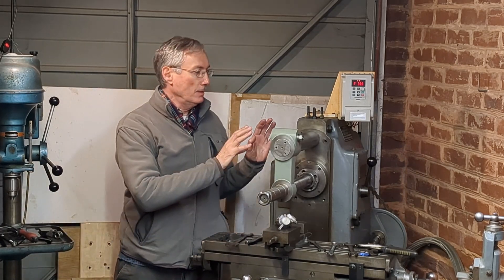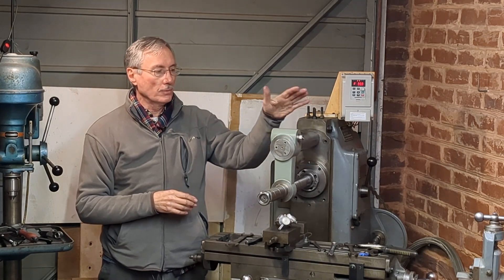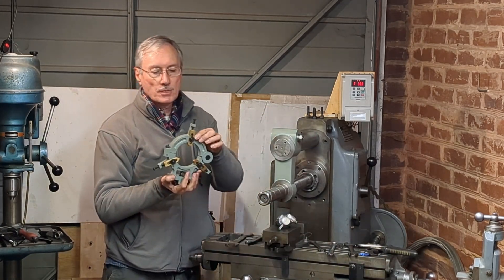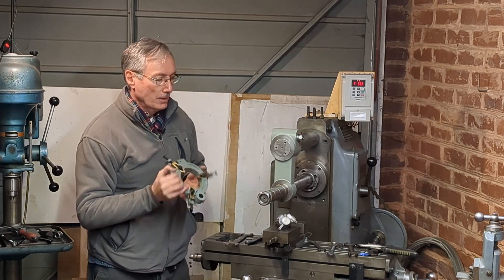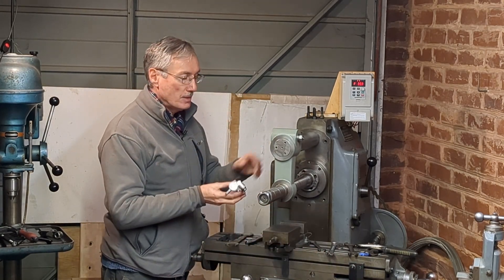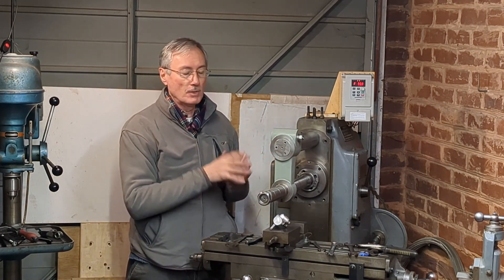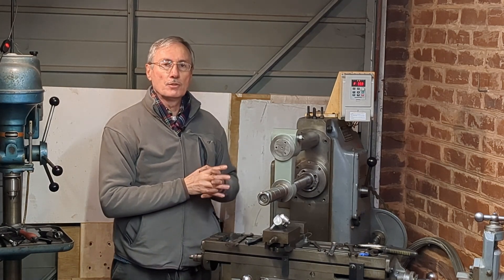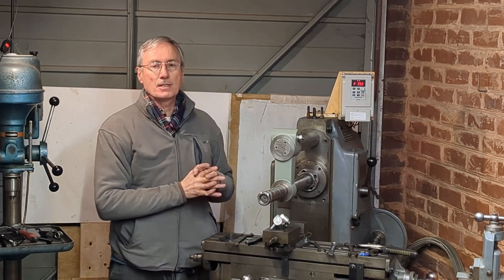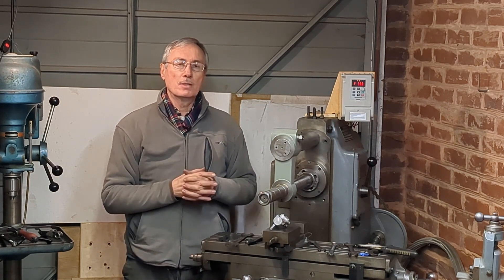It's been quite a journey to get to this stage where the horizontal function of this milling machine has been restored — going all the way back to making the wooden patterns for this casting for the overarm support bracket, plus the two castings necessary for the large fixed steady which I needed to machine the bar, and along the way the DTI holder which has been used a great deal in this project. This is equipment I'm going to use in the future, as indeed is this horizontal milling function. I'm not saying the work on the milling machine is finished — I'm going to come back to this — but certainly this phase of the project is finished, and I think it forms a natural break to look at something else. Hopefully we'll start something new in the next couple of weeks.